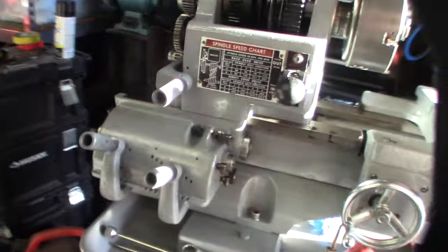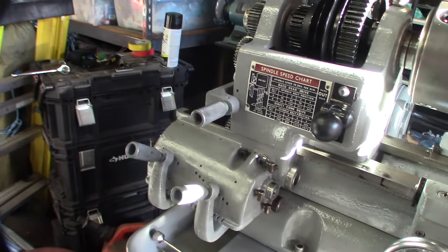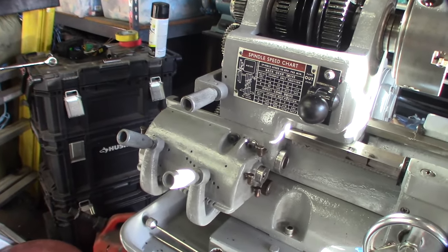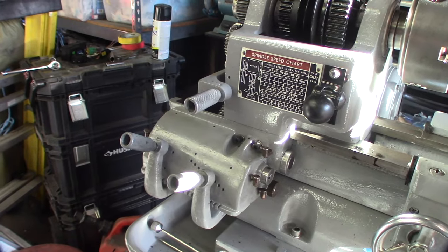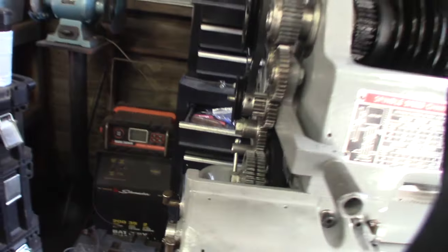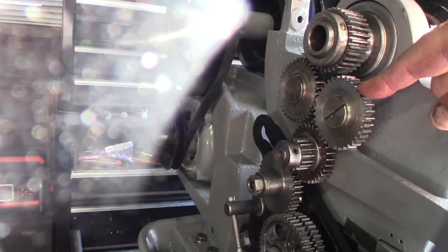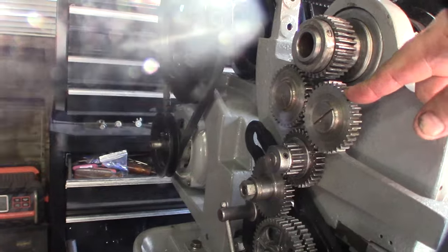Yeah, these things were completely clogged up. So all these shafts weren't even getting lubed. At least a couple of them were completely clogged up. So I blew them out with the air compressor, ultrasonic cleaned them. I probably got 8 hours in this, just the gearbox, scrubbing all these gears by hand, with oven cleaner. Even my ultrasonic cleaner wouldn't get the oil off.